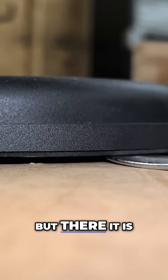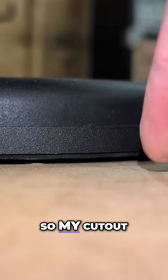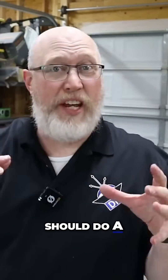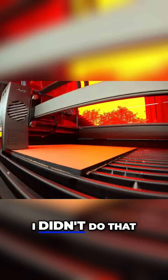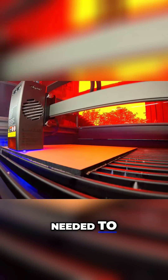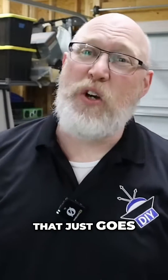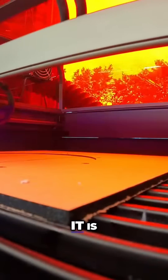I got an air leak right there. My cutout was a tad bit undersized. I always say you should do a test fit on your baffles before you start assembling things. I didn't do that this time — I didn't think I needed to. I had the measurements from the manual and a CNC machine. That just goes to show you, you always do a test fit. There's always just a little bit of variance in the manufacturing process.